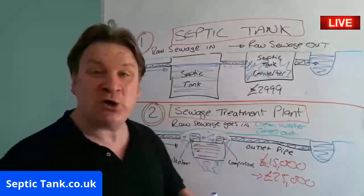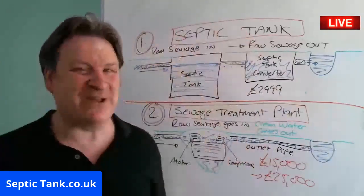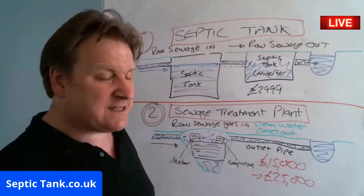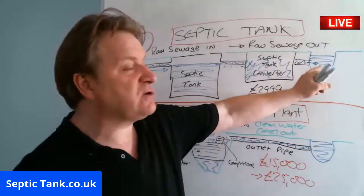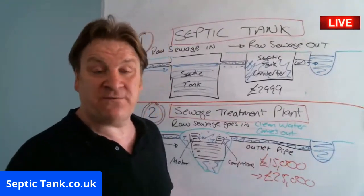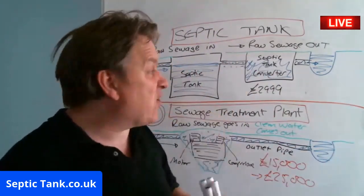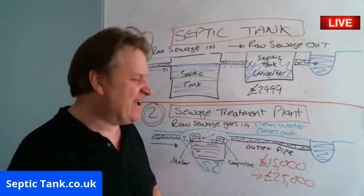For me personally, I've been in the game for 20 years. I consult for the Environment Agency and UK Building Regs and everyone. And I love helping people find cost-effective solutions to their septic tank and soakaway problems. The point I'm trying to make is this: if I had a bit of land and I had a septic tank that goes straight into a watercourse, I'd just put a septic tank converter in, because they're non-electrical, they can't break down, and they don't need servicing every year. They work on venturi suction, so they suck air in and exhale air, and the bacteria in there eat and treat everything, converting it into safe, clean, organic waste water. They're really amazing.